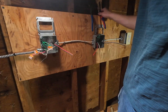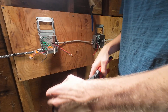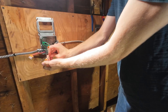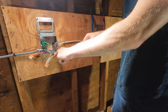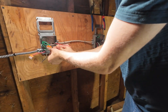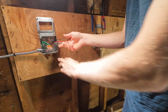Now let's do our neutral. Switches don't touch the neutral — the only thing you're switching with any switch is going to be hot legs. Just like that, stripped a little bit off my incoming neutral, it just goes under a wire nut with my outgoing neutral. That way at the end of the line I have a return path for my current via the neutral, and then I have a secondary return path for my ground. Now I'll shove this neutral in the back of the box to give us as much space as possible. I'm going to shove this unused hot — it's red — in the back. Don't get confused, we don't care about it.